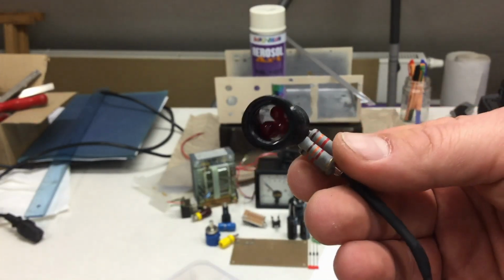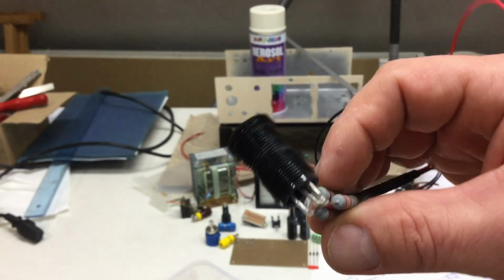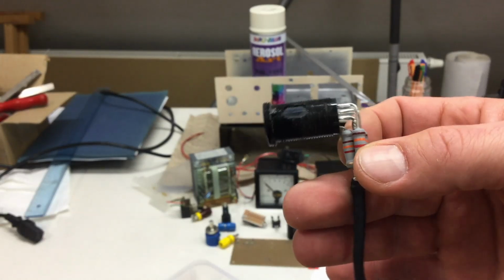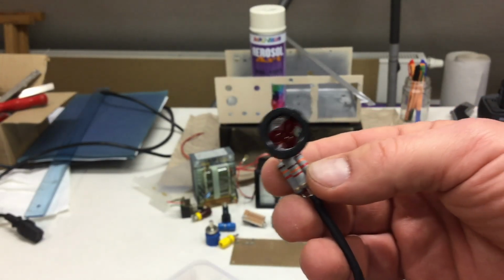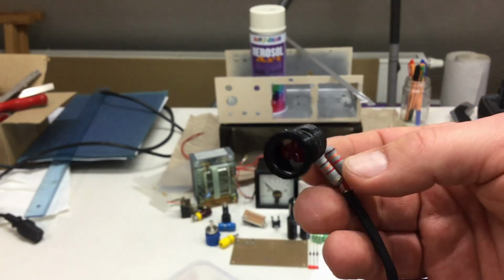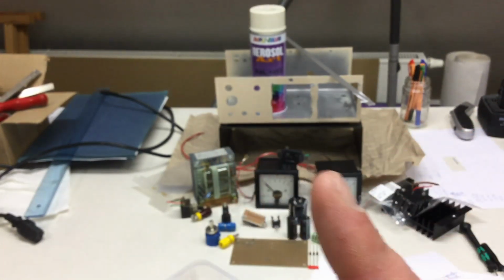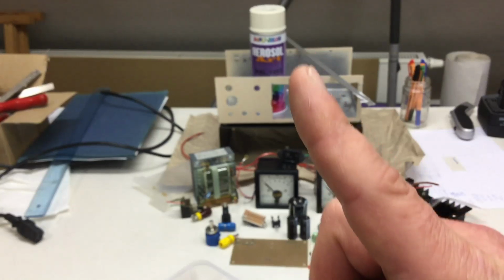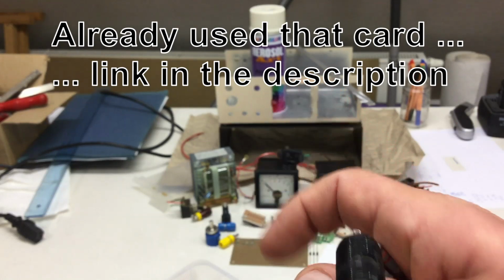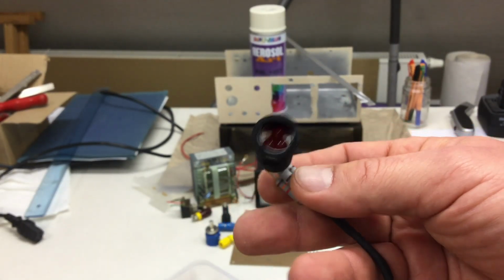Yeah, it's not only an indication that the thing is on, but also some basic load on the main filter capacitor, because I will use a voltage doubler for the negative rail, and then you need some load on your main capacitor. And if you didn't know that, have a look at this video about auxiliary negative rails for power supplies.